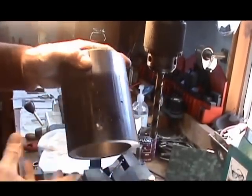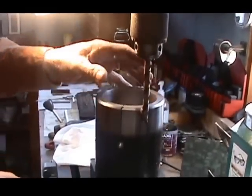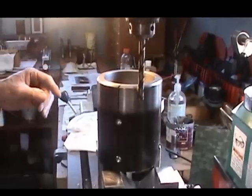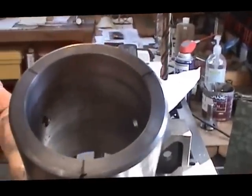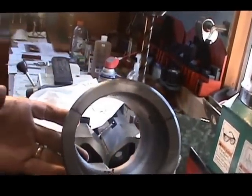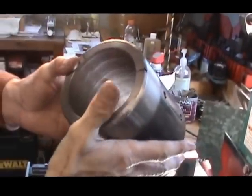And we'll drop a little 3/8 plug in there short of the inside diameter and weld the outside, smooth them up, and that'll leave those little round holes on the inside, as you can see in there. We'll clean little burrs up on those, of course, but that babbitt will flow up through there and go into those little holes and keep that babbitt from spinning on the main shaft.